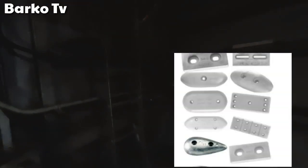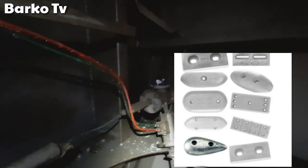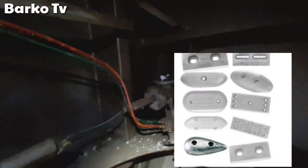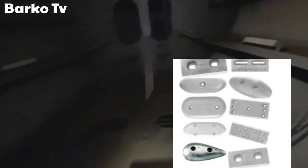In our case, our sacrificial anode is zinc. Sometimes the sacrificial anode is composed of zinc, aluminum, or magnesium, but on our ship it is a zinc anode. This anode is rectangular and installed with a bracket, secured with a bracket.